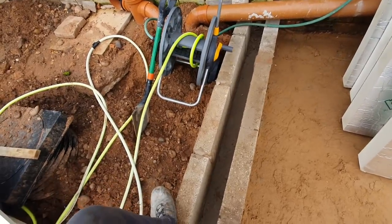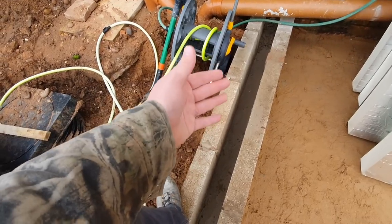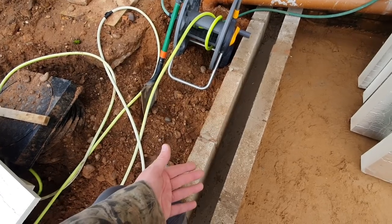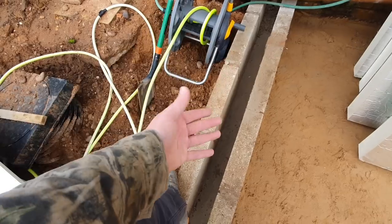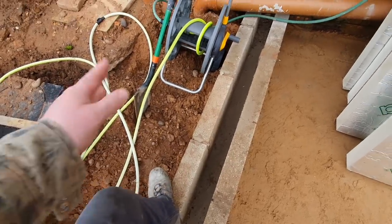This has all been filled 220 millimetres below finished floor level, and then that gives you some drainage if there's anything that escapes the cavity tray below, and then you bench it forwards to the outer leaf.